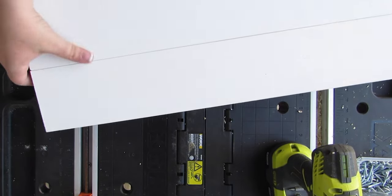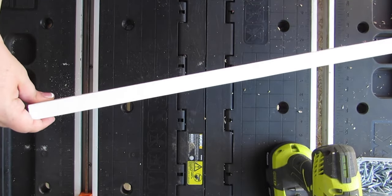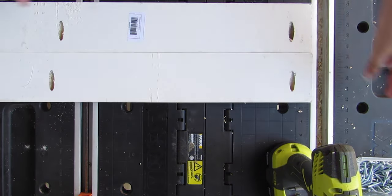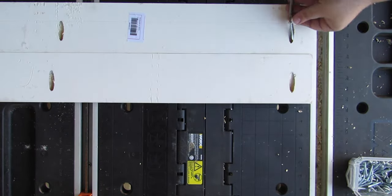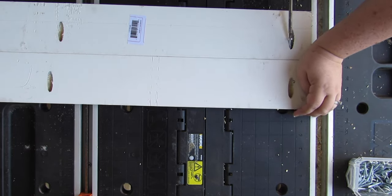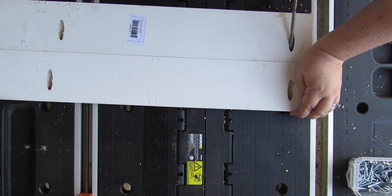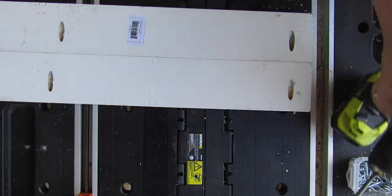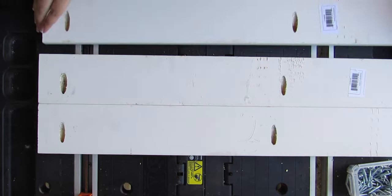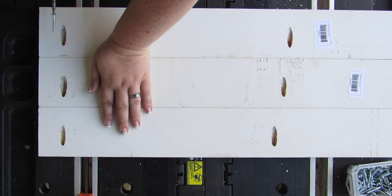Perfect. And I always like to turn it over and just make sure that it's not coming through the front. It shouldn't be. It's 3/4 inch wood. But when I made 2 of these gates, the first one, this one that I'm showing you, worked beautifully. Same exact wood, same exact screws for the second gate, but it started to come through the front a little, because not all wood, even if it is supposed to be the same dimensions, is 100% the same dimensions sometimes. So I just switched to 1-inch screws on those and it was fine.